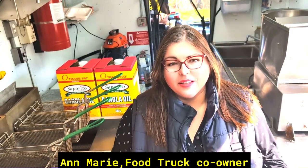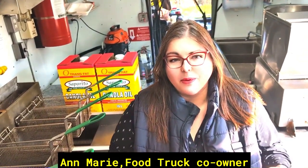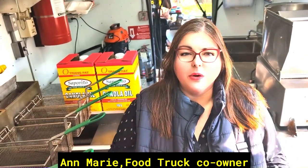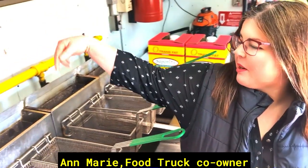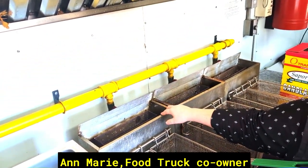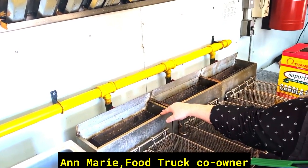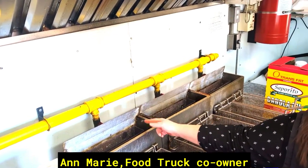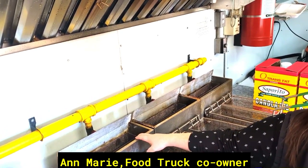Hi, I'm Ann, and today we're going to teach you how to clean your fryers, more specifically the burners and baffles under your fryers. So say you're a new food truck owner. You've gone out on a job, you're on site, and all of a sudden you see flames coming out of the stacks at the back of your deep fryers. If this happens, it means that you have trouble underneath your fryers, and that trouble is filthy burners and soot-covered baffles. As soon as you see flames coming out of these stacks, you have to shut your fryers down right away because they're now dangerous.